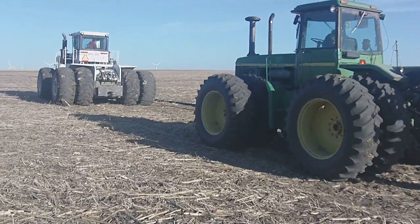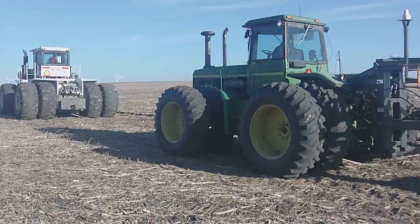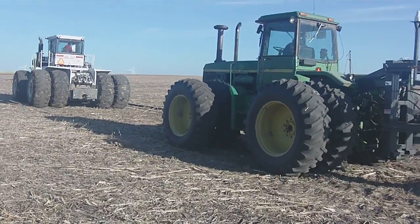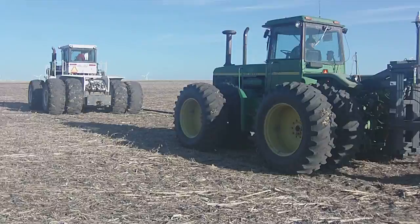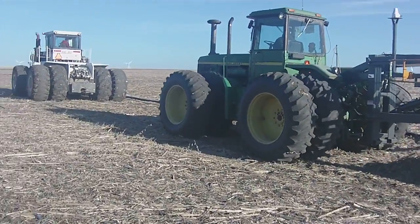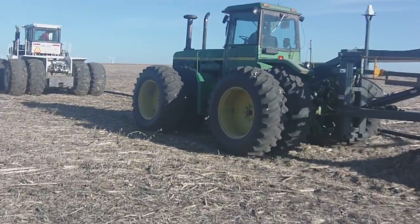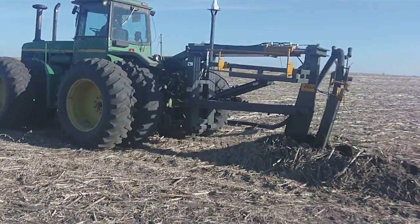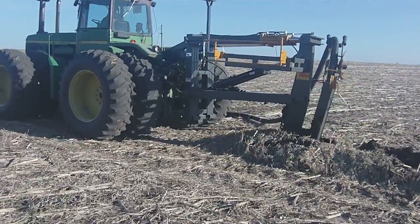The reason we do this is that we look for areas in the field where yield production has not been as good as the rest of the farm. Many times it's because of excess moisture — the inability of the ground to have moisture taken away from it. The six-inch tile will now be able to capture the water in the soil profile.